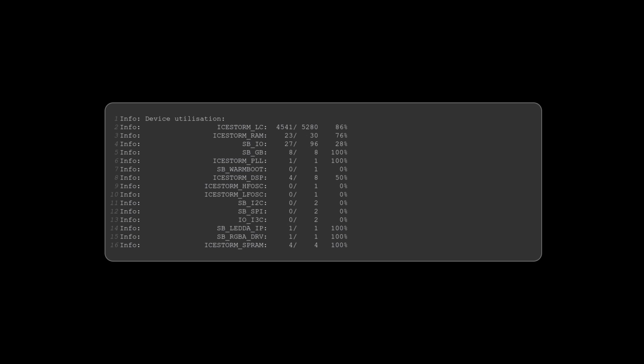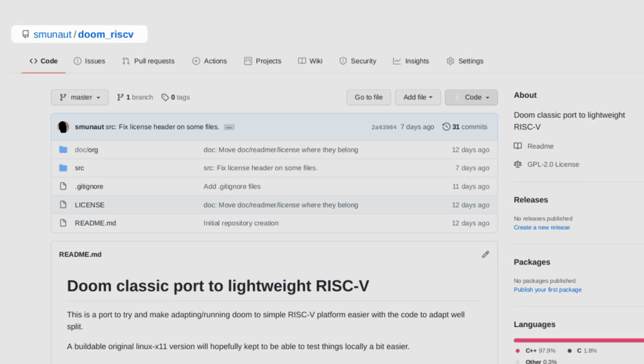Timing-wise, it's not trivial to find a seed that fully meets the 25.125 MHz timing constraint given the very pessimistic timing analysis from NextPNR. However, it's pretty easy to find one meeting 23 MHz constraint, and that's less than 10% off. Given in typical condition, the timings are almost 50% faster than NextPNR's model, I don't have any issues relying on this. Moving on to the software part of things.